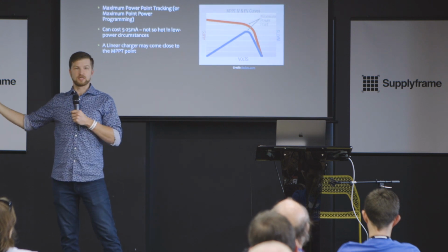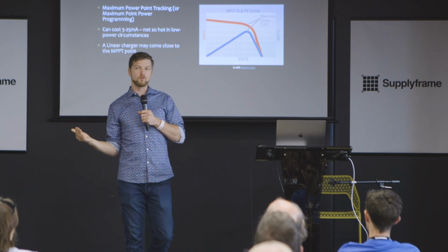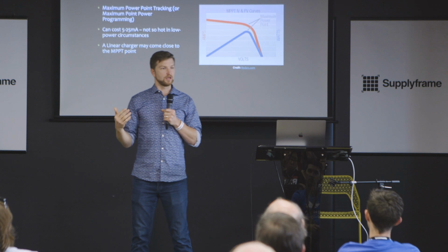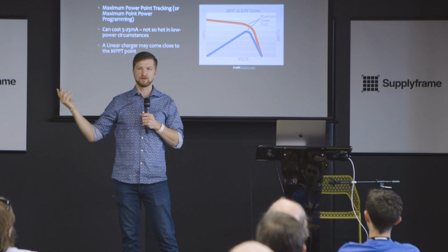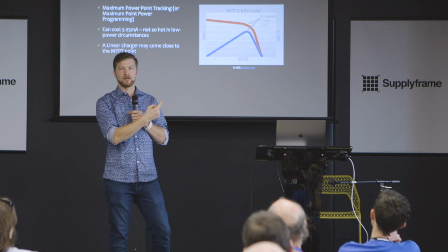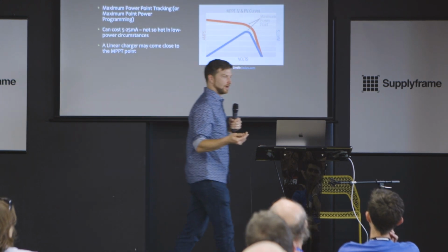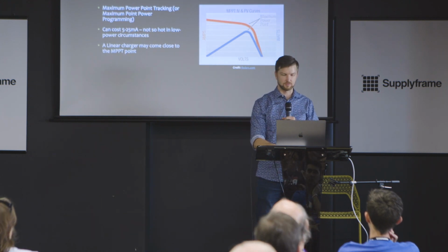So if you're doing 30 watts, it's like, sweet, run it, MPPT, 100%, gotta have it. But if you've got a 1-watt or a 3-watt panel sitting there, now all of a sudden your efficiencies are getting killed by that offset. And even worse, in the morning, you might be using more energy than you're getting because the sun just rose and you're chewing up 25 milliamps, but you're only getting 5 or 10. So it's a bad deal in a lot of cases, to the point where putting in a linear charger and dealing with all the heat loss is a preferable solution, not to mention a tenth the cost. So make sure that you're considering all these fancy devices relative to what your system requires.